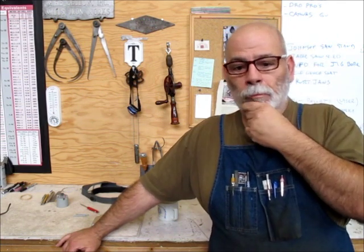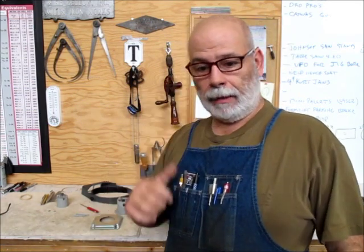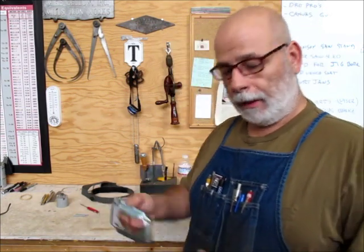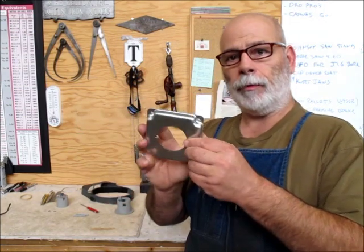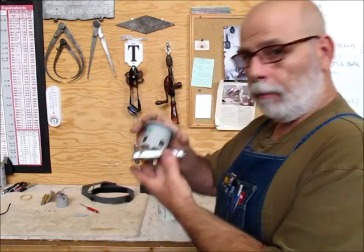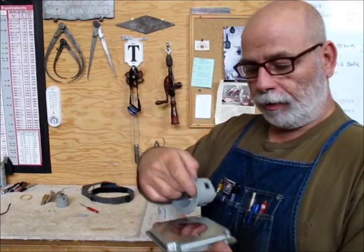This morning we're getting the Clausing drill press wired up, and a little job popped out of the jack-in-the-box. It's a three-phase circuit we're putting in, and I've got a 4x4 box cover here for a receptacle, but the three-phase receptacle I have — this face-mount job — is a no-go. So we've got to open this hole up.